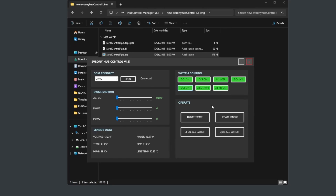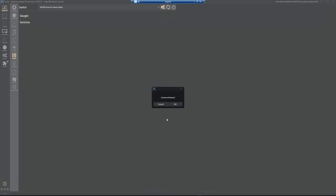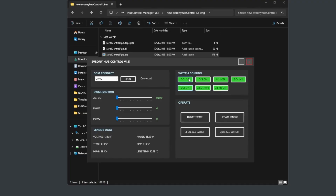In NINA I like to hit the power button in the bottom left corner to connect all my devices automatically, but if the box defaults to all DC ports being off, any device without power will fail to connect in NINA. I've been told there will be a new firmware version around end of November or beginning of December 2025 that will resolve this — it'll remember which ports were on and which were off. But as it stands now: DC ports default off, USB ports default on, and PWM and adjustable voltage values all default back to zero.